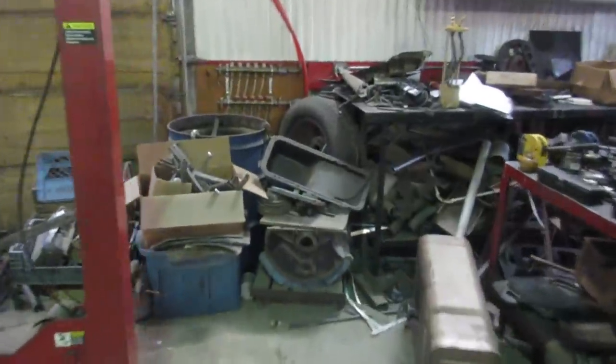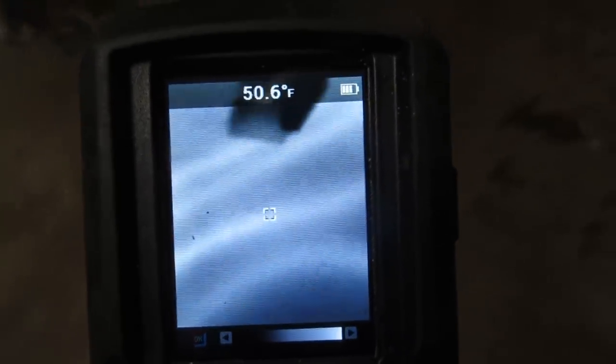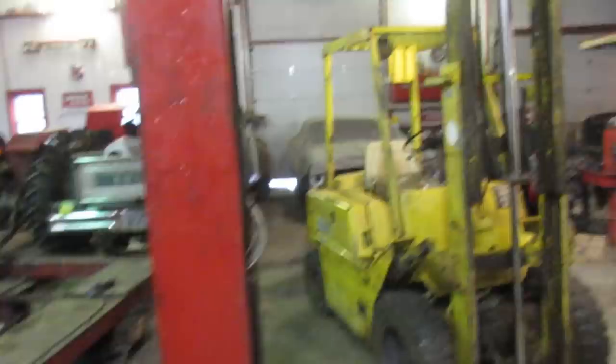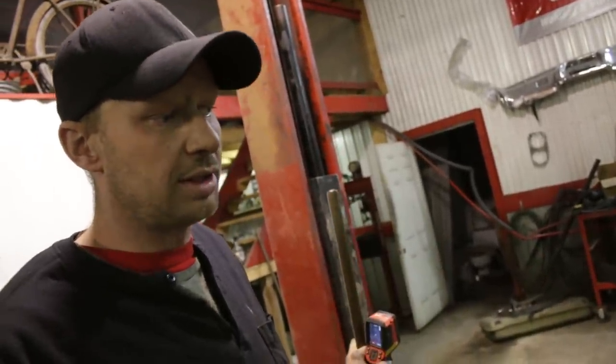This is also my second zone for my heating floor, so all the pipes in this half of the shop end up right there. Me being able to drill this post into the ground is probably out of the question. When you're designing a shop, definitely figure out where you want to put your hoist and pour the concrete thicker there.